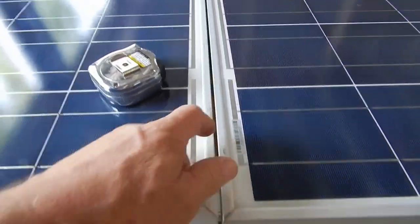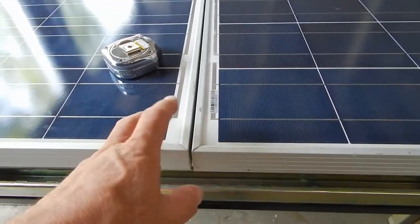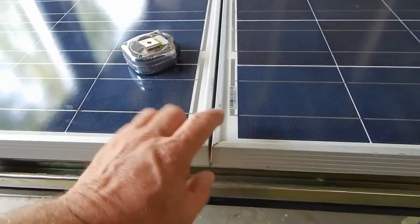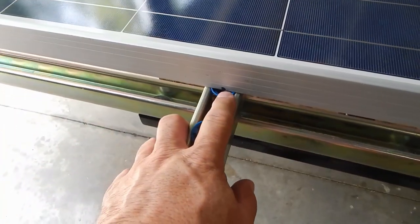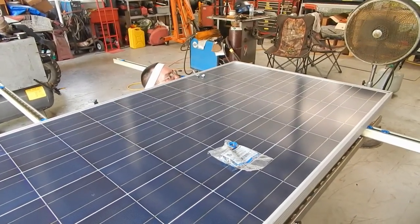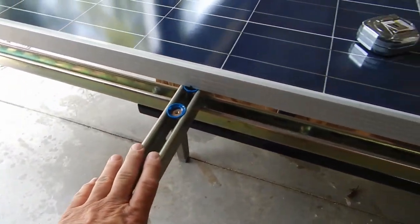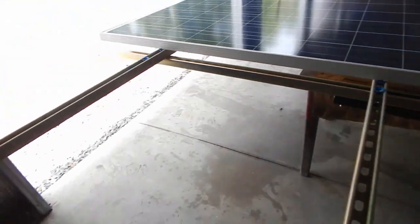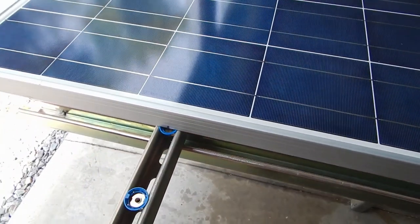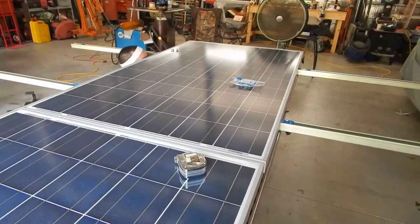It's a good idea when you set these up to leave a space between the panels, because this frame is always twisting like a wing on a plane due to wind load and torsional loads. Keep the gap, then put your bolts in on the first two panels — that's what Marky G's doing down there, making sure they line up. We'll pull the panels off, lock all the rails down, then hook this through the tractor forks and get the rack up on the pole.